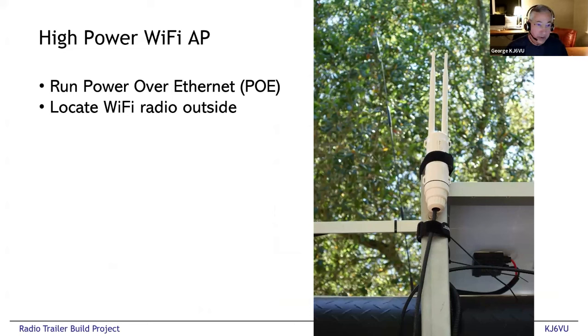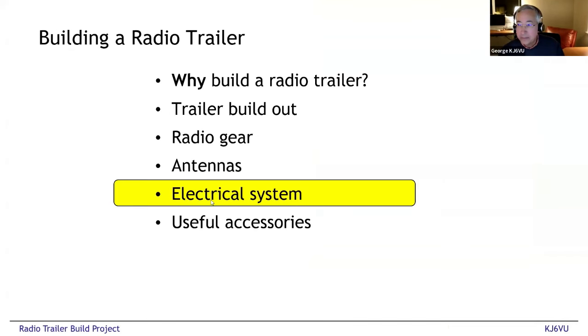This is the Wi-Fi access point. If you're inside the trailer the radios are hardwired, but once you're outside, since it's kind of a Faraday cage, the router inside has limited coverage outside. I wanted a longer-range access point so that if you took your Flex or logging computer 300 feet away, you could still get back to the trailer. Putting an outside, higher-power Wi-Fi AP was a helpful addition. Plus, if we have the cellular radio turned on, others at the site could use that for additional cell phone coverage.